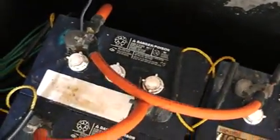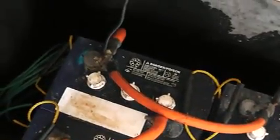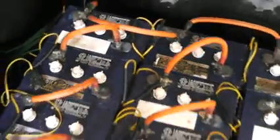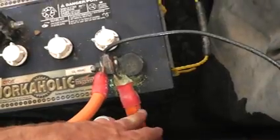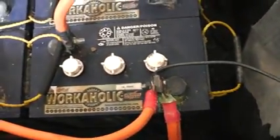If you look way down in there, you can see that big orange wire going off — it's coming off the negative on this end of the battery array. And then this one over here is coming off the positive on this end. So those two wires — this one here and the one all the way at the other corner — are what's going out of the battery bank and into the charge controller. You wire the final two wires off the end of the battery bank.